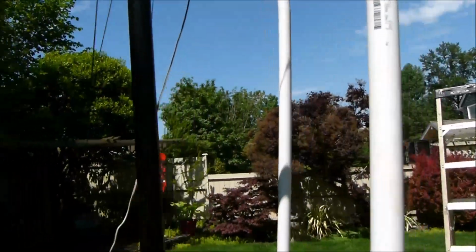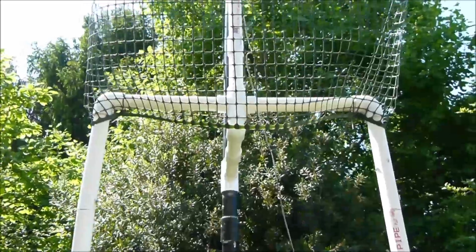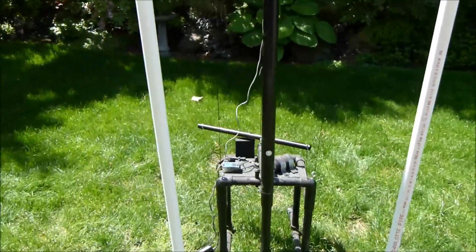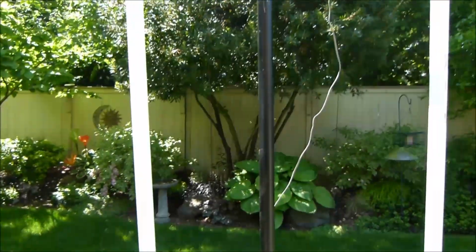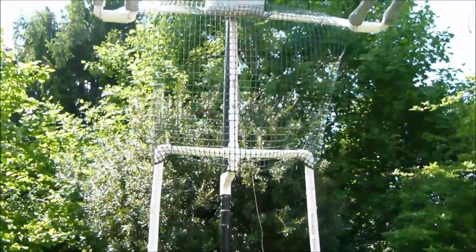So what I ended up doing, I wasn't sure if it was going to work or not. I put in a cross brace right there, 2 feet out. I took 1-inch pipe, went down, goes into some rebar right now, and it sways, and I was hoping, which it did work, that with the 3-point axis, it wouldn't fall over.